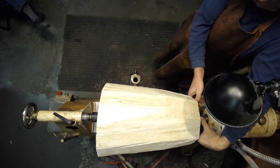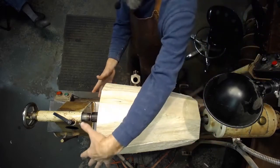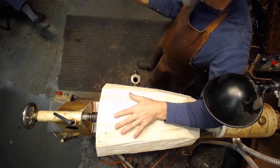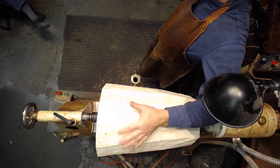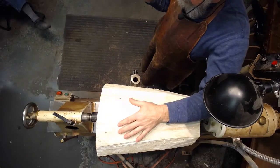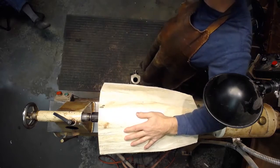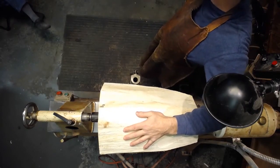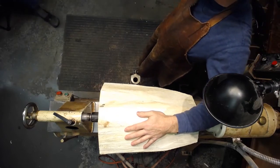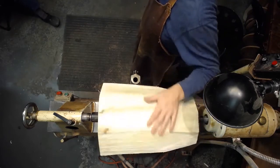The annual rings are about 6-inch diameter at this end. The large end is centered on the bark, essentially. And I do that because if the pith was right up the center of the tree, they'd be the same thing, but in most trees the pith is off center. By doing what I just described, you end up getting the annual rings across the shade more or less horizontal. Now, trees aren't exactly round, so the annual rings will sweep up and down. But if you look at that shade that's lit over there, you'll see the annual rings are the horizontal lines, and they're pretty close right across.